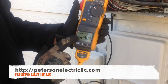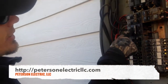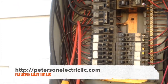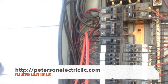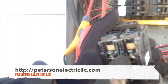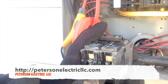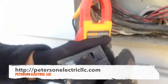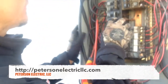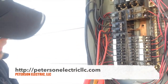That's 239 amps with an inrush shot, and that was on the B phase. The original breaker looked a little darker on the B phase when I grabbed it — discolored, which shows me it definitely got hot on that B phase. The breaker just won't reset, so we put this new one in and gave it one shot to see if it would work. It usually gives you one or two chances and then you're done.